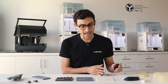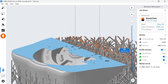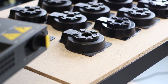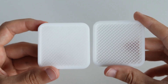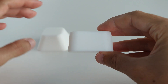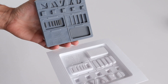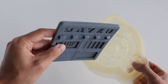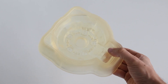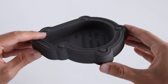Now let's talk about the lifespan of a template. The design and 3D printing settings will determine the template's useful lifespan. However, there are some things worth mentioning if you want to use the same templates over and over again. FDM templates require a thick shell and a high infill density. Due to the layered surface, they are more difficult to demold, so you may want to increase the draft angle or use a release agent. SLA templates demold better than FDM templates, but they may warp or even crack over time if you use the standard gray or clear resins — good for prototypes, but high temperature resins are better for small batch production. When it comes to reusability, SLS templates offer incredible performance thanks to the material properties.